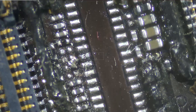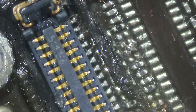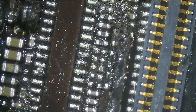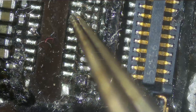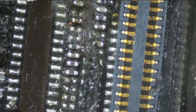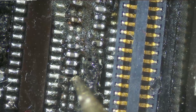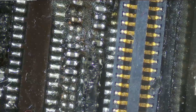Now let's get the part from the donor board. I've already used a lot of components from it, including the FPC connector and various filters. Based on the board diagram, we need a filter located at the 10th pin. Counting: one, two, three, four, five, six, seven, eight, nine, ten — the filter is right here. Let's test it to confirm it's a filter — it should be continuous from end to end. And it is a filter. Let's remove it.